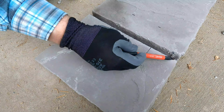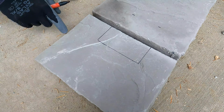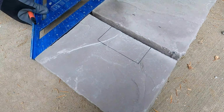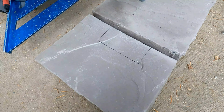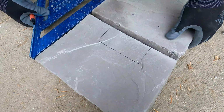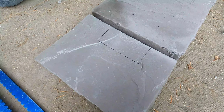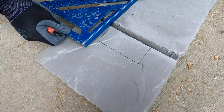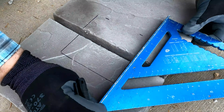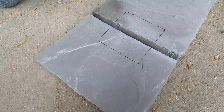making sure that this is all the right size all the way across and balanced, so that this factory edge lines up with this factory edge. You can use a square to get that before you mark this. You can measure off of here to mark this, but you got to get these lined up before you mark the other one. So we needed to slide it just slightly right there. So now we can transfer that straight across now. So that's the size of our post.